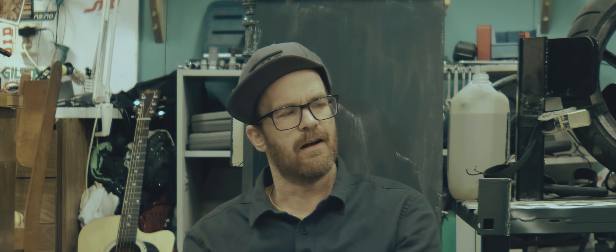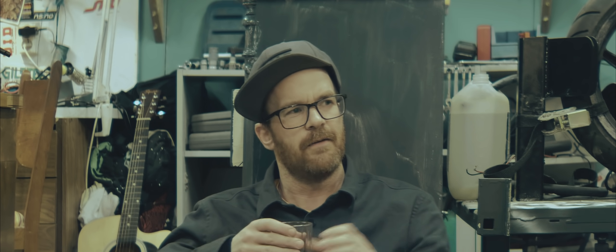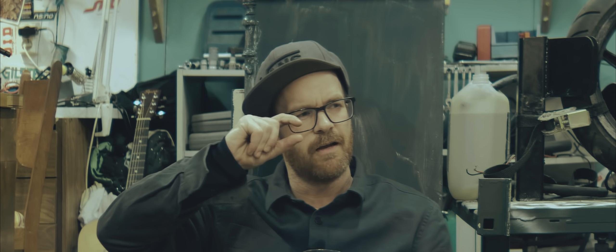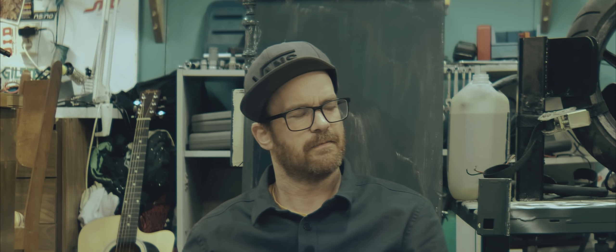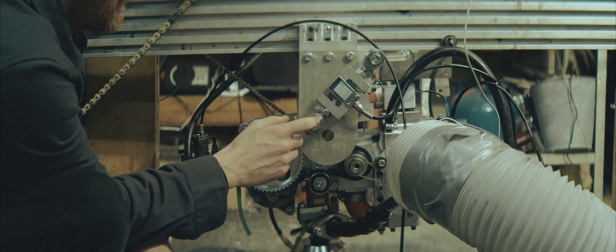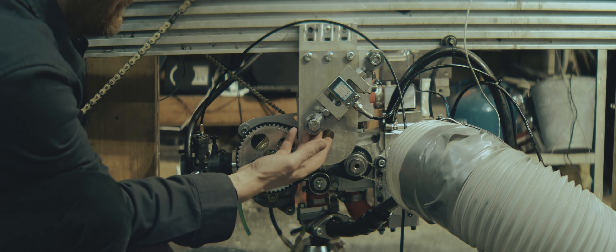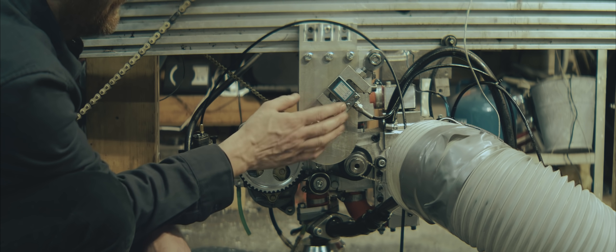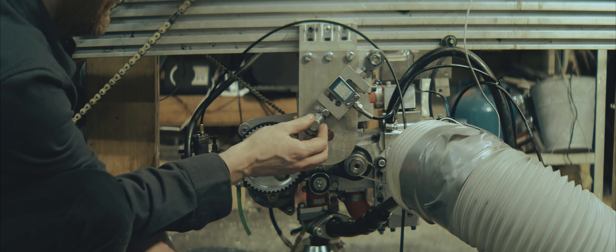The thing is, it's a 50 kilogram load cell - 500 Newton. I can't mount it very far away, because if I do it will just use the tiniest bit of range it has to offer, and I'm not sure that's really a good idea. I just realized something - the current calibration, five kilos hung from here, that's 10% off the rating for this load cell. That might not be enough to calibrate it properly.